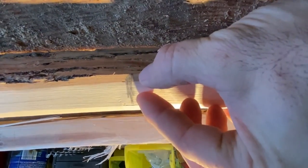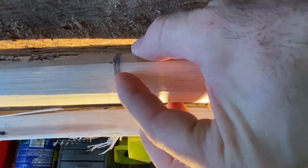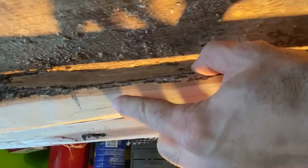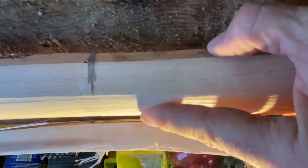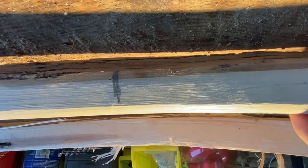The more that we work this down, the more radius it'll have. You can go pretty thin here — so if we start with about an inch and a half, which is what this is, I can be down close to an inch on this radius. Actually, the thinner it is, the easier, theoretically, it's going to be to bend once you steam it.